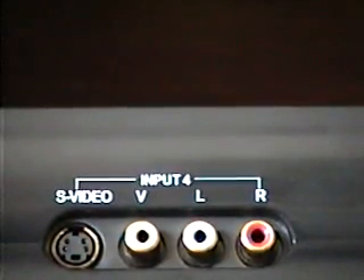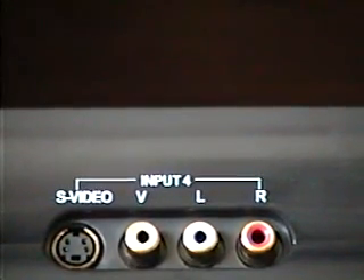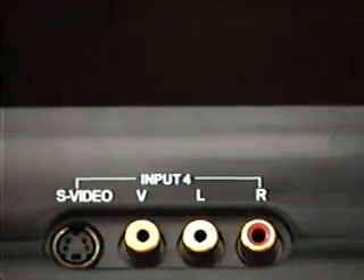What I'm going to do is connect this cable to the modulator. This is how you would do a mono connection. The S-video jack is for another kind of cable which I don't have at this point to show you, so we're going to disregard that input for right now. But I am going to show you the others. Here's what you do to hook up a mono signal to a stereo compatible source.